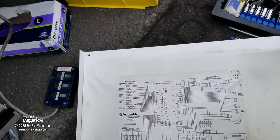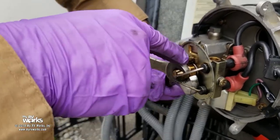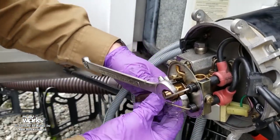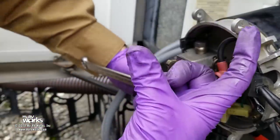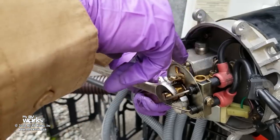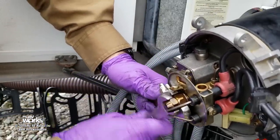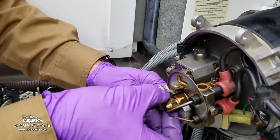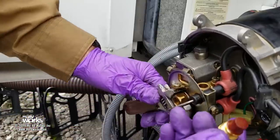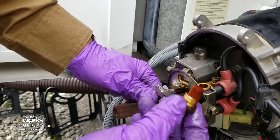We followed the schematic. Now we're going to replace the fuel nozzle — that's a five-eighths socket here. Five-eighths fits perfectly on the nozzle. Make sure you use a backup wrench because this brass piece that sticks out is only about this long, and if you put tension on the end without a backup wrench you could torque and bend this tower. Always use a backup wrench — I'm just using an adjustable. So that was dirty — the fuel filter allowed some stuff to get through and degrade the fuel nozzle.